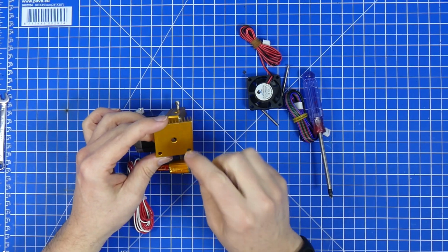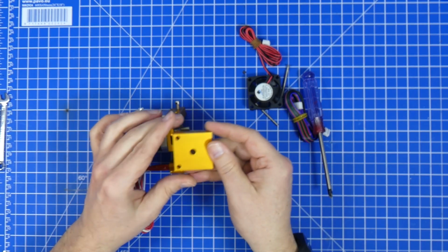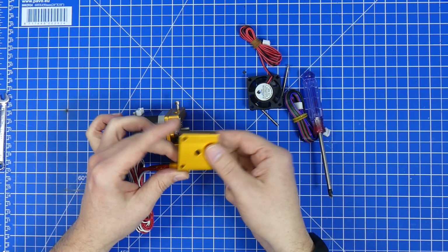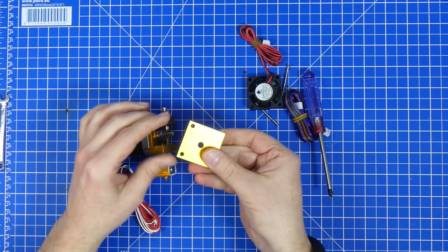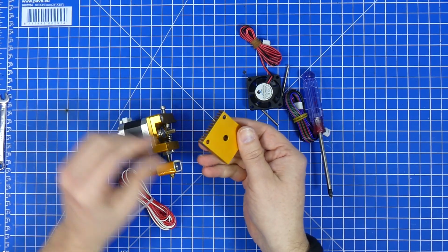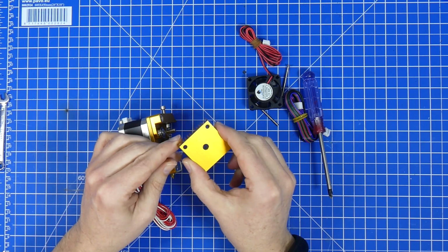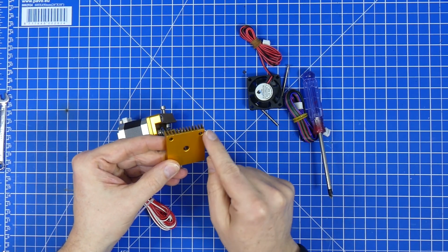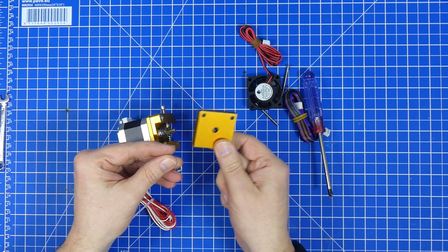The second problem is this cooler here. Now, this cooler has this coating on it, and there's a very nice video from Big Clive where he's showing off a diamond tester, and what he finds out is that this coating here is absolute rubbish. If you want the heat to go from this block into this cooler, there should not be anything in between here. No coating, no nothing. So what we're going to do later is we're going to take a file and some sandpaper and we're going to remove that until it is perfectly flat, because that is point 2. With these 2 drill holes in here, this is not going to be flat anymore because it was drilled, and as it was drilled, material was deposited right around the drill holes. We're going to see that.